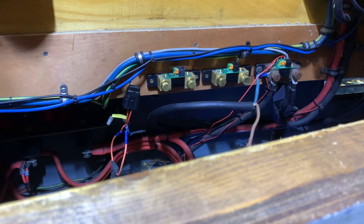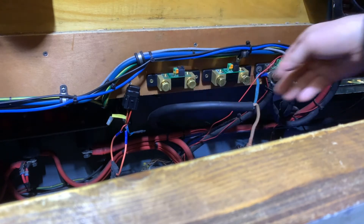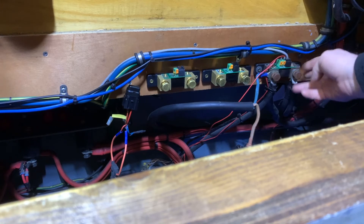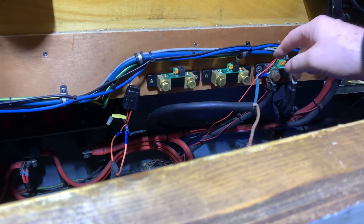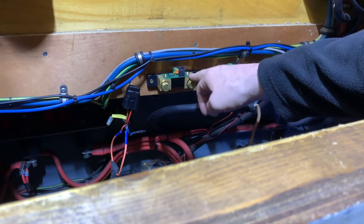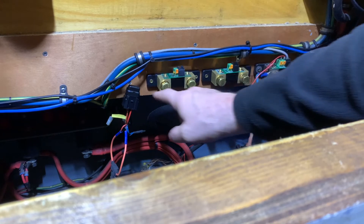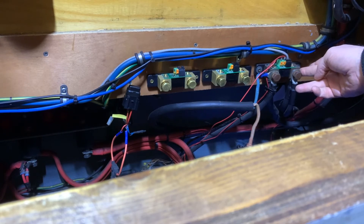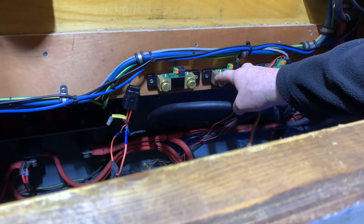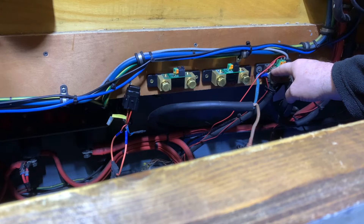The shunts are in place. Just to explain a little bit what's going on here. The right-hand side, as you look at these shunts, offers the battery feeds on the negative side of the battery. Currently you can see that the lead acids are feeding into the negative side — that will get disconnected. The negative terminal from the first lead-acid battery will feed into here. The negative side from the two lithiums will feed into here. The output sides of these two shunts will come into the negative side or the battery side of this master shunt here. So then we'll be able to monitor the current going in and out of the lithiums, the current going in and out of the lead acids, and then the combined current going in and out of the battery bank as a whole.